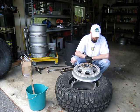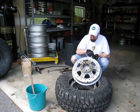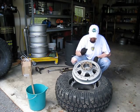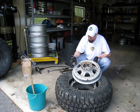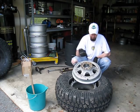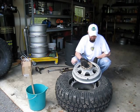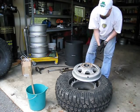What we're going to do is reinsert this O-ring into the little track — the channel — that runs all the way around the inside of the front plate. This can be a little bit tricky. I'm going to take the gloves off to make sure I'm not getting debris on the O-ring. We're going to take a little bit of Vaseline and lubricate this ring, just to give it a little extra stickiness as well as help it seal up once we assemble both pieces together. I'll take the gloves off, clean this up, and be back in a second.